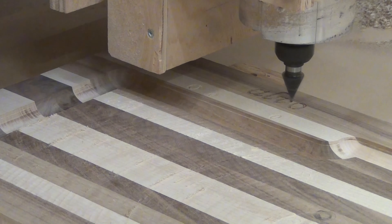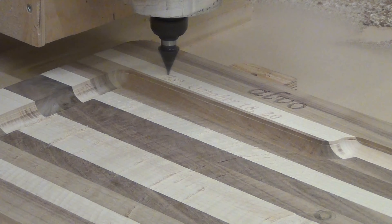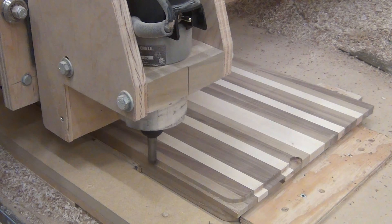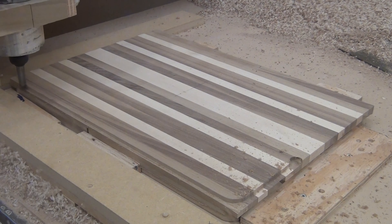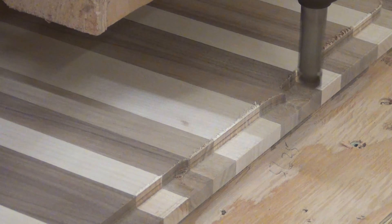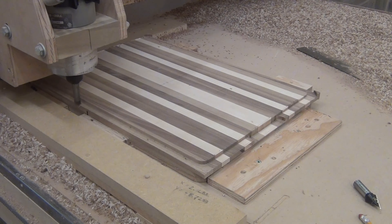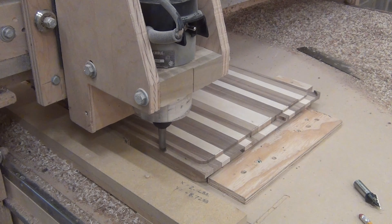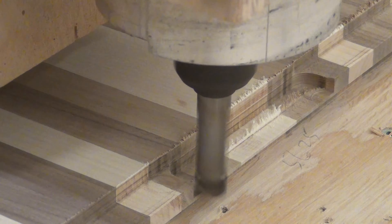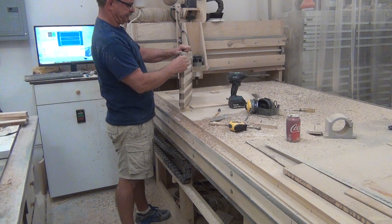Here's something we only did once. On the bottom I cut this profile — this is a rough climb cut. I leave two hundredths when I do this profile, in the finger holes as well. Then when the rough is done I come back with a conventional pass and take the two hundredths off all the way around. This finish pass makes for a nice clean finish. And finally we're done.